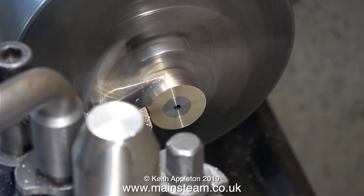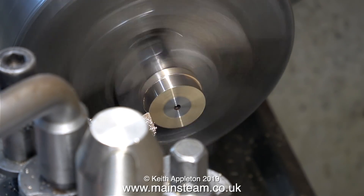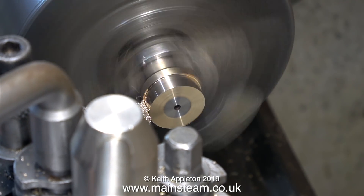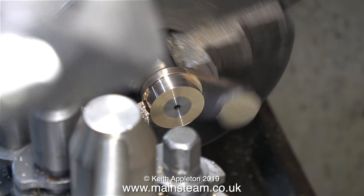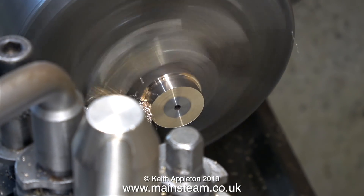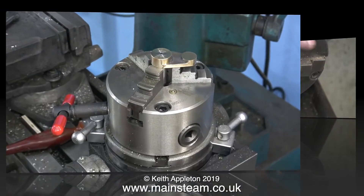The hole in the centre of the crank web is at 90 degrees to the front face, but the outer part of the casting is uneven and I can't live with that. Some engineers leave a casting as-cast, but whenever a casting is rotating I like it to look like it's running with some degree of concentricity. That's why I'm taking many cuts to get through every part of the rough casting skin. I finish off the job using a file to remove the sharp edges.